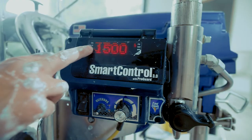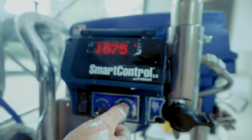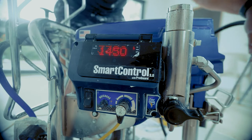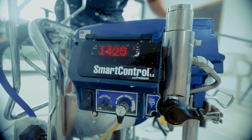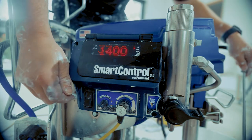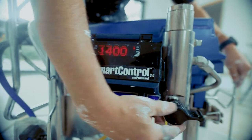As you can see, we've got pressure in the machine. What we're going to do is turn the dial to zero and make sure that the prime hose is either being held or released in the hopper so it can't just flick out. I'm going to hold it with my hand and slowly release the prime valve down — this is going to relieve all the pressure.